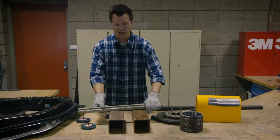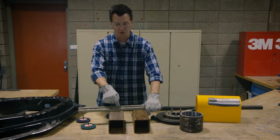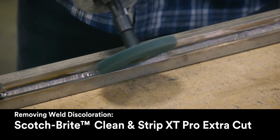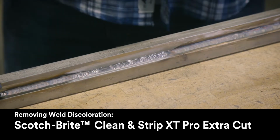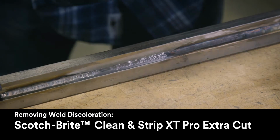The next application I'd like to highlight here is weld burn discoloration. So this heat discoloration, if you want to remove that on a stainless steel part and polish off that weld, we'd recommend using the Extra Cut version. And this Extra Cut is going to conform to that weld bead and bring that stainless steel weld to a nice polish.